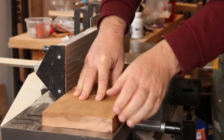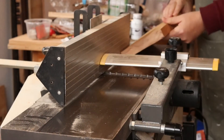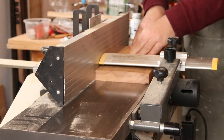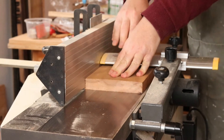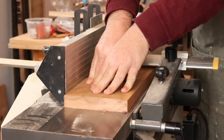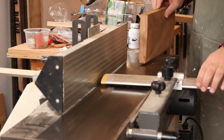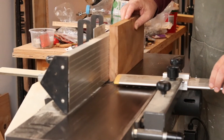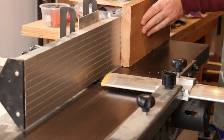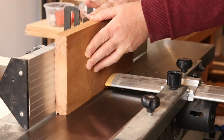This is the first step following the wood coming from the sawmill. The surface is planed completely, and as we put it through the jointer, different layers are becoming visible. Once the complete surface is planed nice and flat, the next step is to create a 90-degree or right-angle edge to that already planed surface, and that's done on the jointer as well.